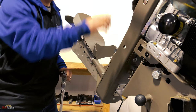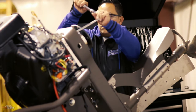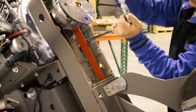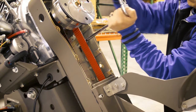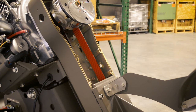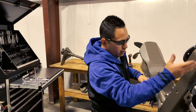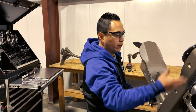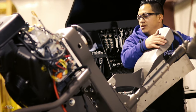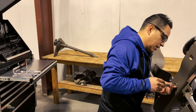We've done the ones in the back, now we're going to jump to the front. Once all those bolts are tightened, make sure the motion base is straight with the motor. Then spin your prop again three or four times and double-check the tension one more time just to make sure it did not move.